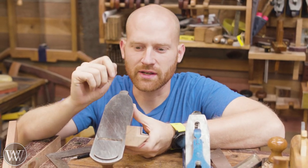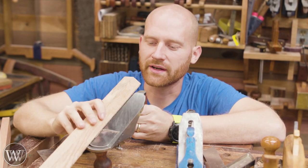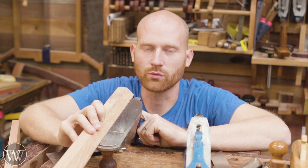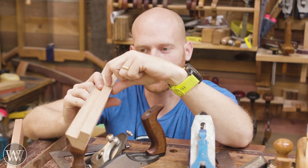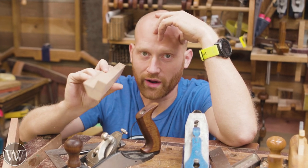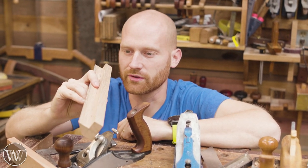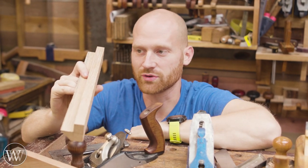I've run into a bit of a problem — I did a miscalculation. I measured the width of the iron but did not take into account the thicknesses of the sidewall. So when I put this molding on, it doesn't reach the middle of the iron. That means when I cut this in half and put one half on either side, my chamfer is going to be at the smallest possible seven-eighths of an inch wide, which is way too big. If I reset the track further in, the wall gets too thin — down to about a quarter inch — which isn't strong enough. So I'm going to cut off this whole lip and laminate on a piece of cherry, glue that in place, and that will become my new substrate.